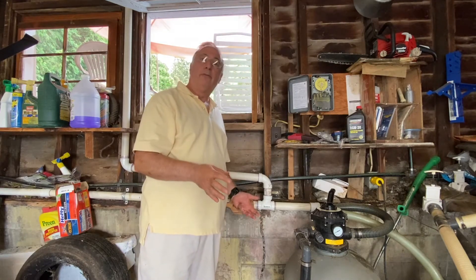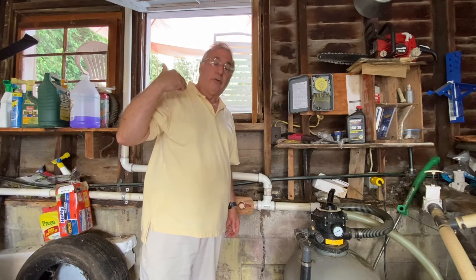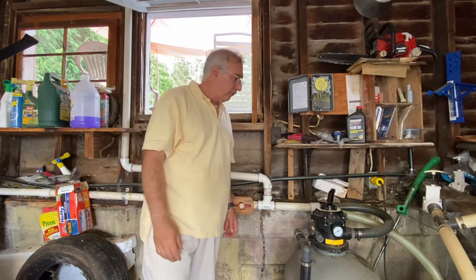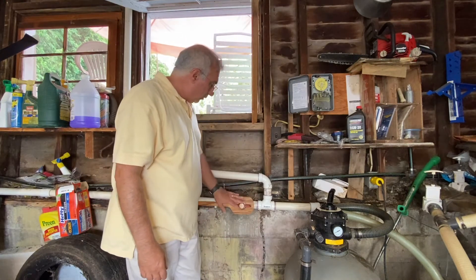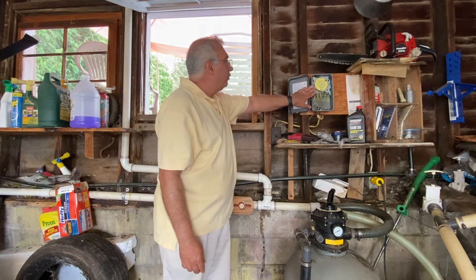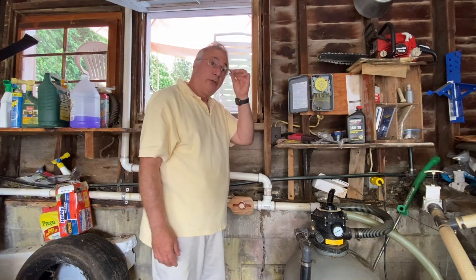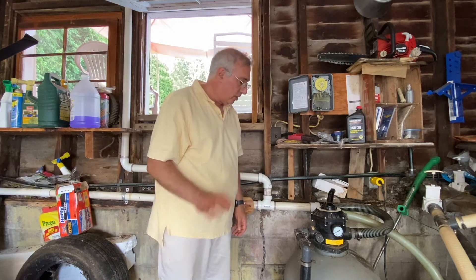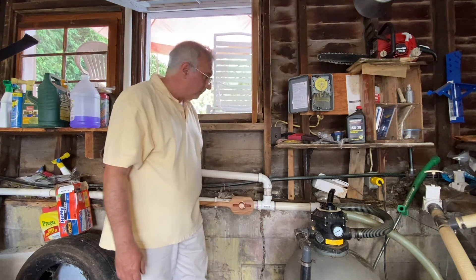If you don't bypass the solar heater on a coolish day like today, it turns into a solar radiator and you're dispersing the heat from your pool into the atmosphere — and that's not what we want. So today we have that valve closed. Most of the summer, we can just use this timer up here to turn the pool filter off at night so that after the sun goes down, we're not pumping any water at all, not cooling it off. Occasionally we have to come out manually and turn it off, but most of the time we do not.